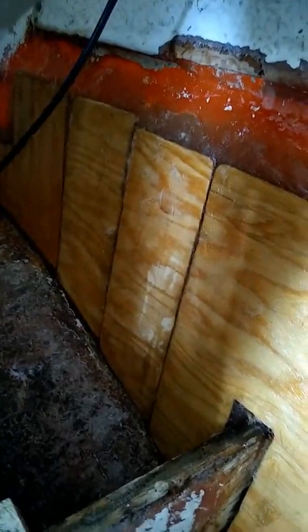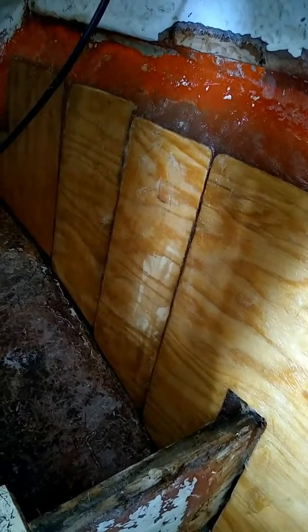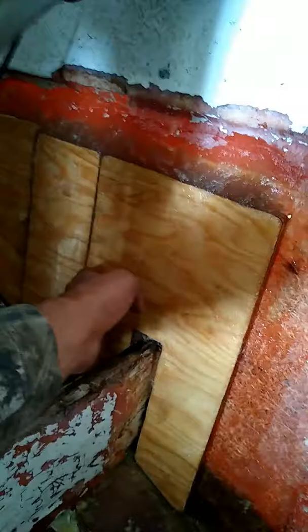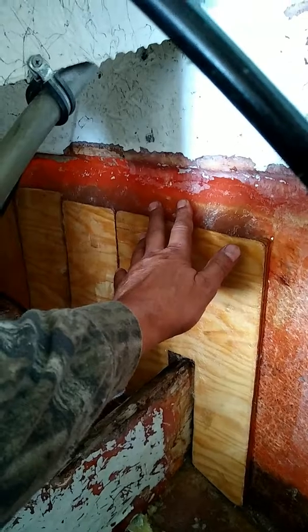Sanding and acetone before I can cover that in fiberglass, which is what I'm going to do today. There was no PVA, no gel coat, no air inhibitor put on this — I just closed the door and went home last night. I'm going to acetone that side, do some light sanding on this side first, then light sand it, acetone it, and then do the peanut butter and the boards on this side, then come back to attempting to tab it in on this side, just to keep the workload down.